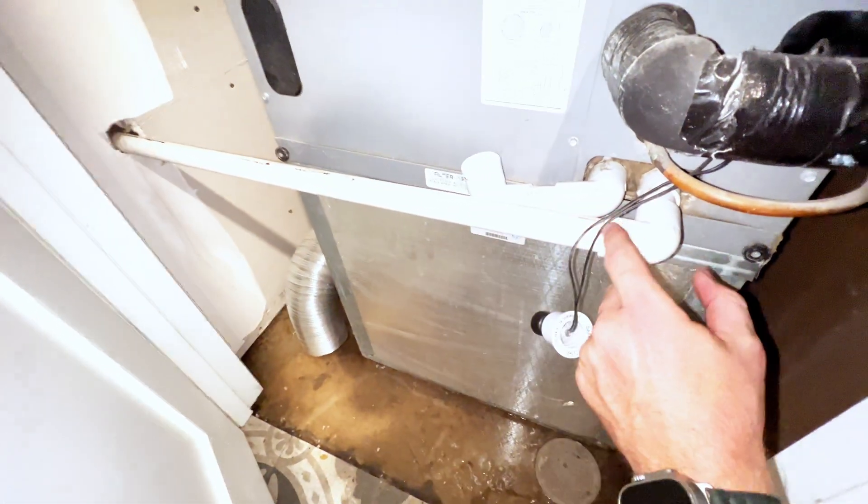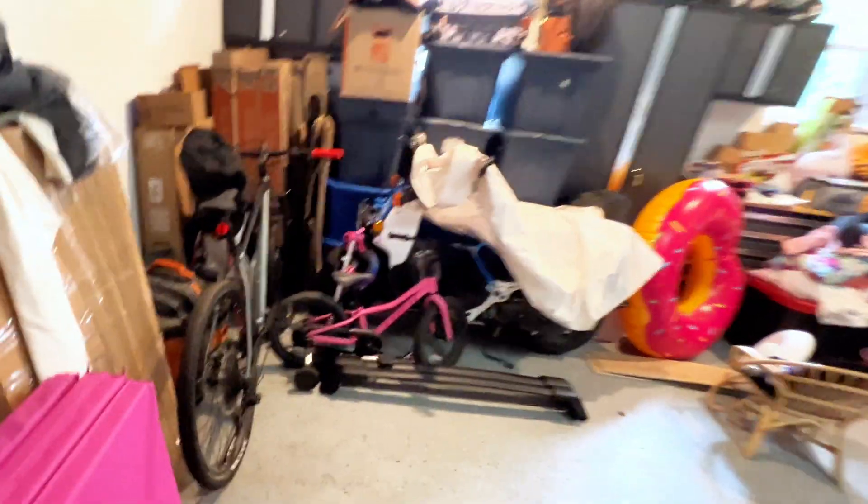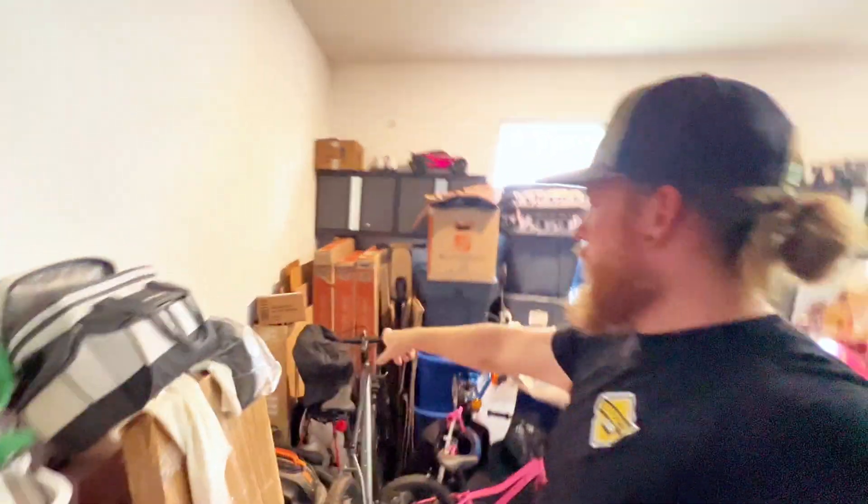I had a clean out probably here or like here. So it comes out that wall there. It's not insulated, so all that — got to get the documentation, I'm taking pictures. It needs to be insulated running all the way out and that's why they get these water damages. I'm just going to write that we redo it. That whole section right here needs to be removed, pull and wrap up a new drain line, rewrap it in insulation, figure out the side wall, add a clean out right there, get a new float switch. The bottom of that return base is going to be all sopped up and gross.